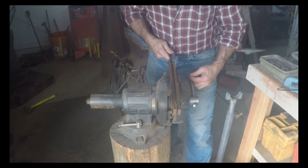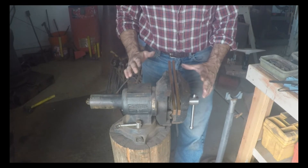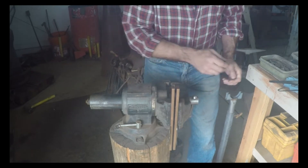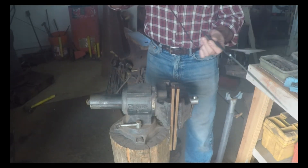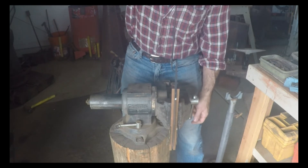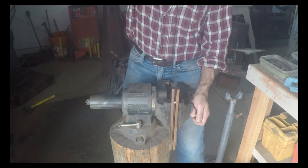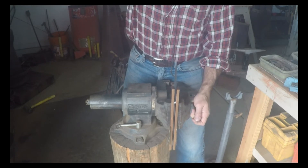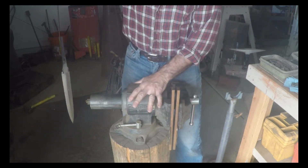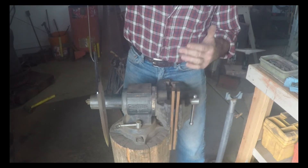The really important thing is that whatever you set this vise on, you need to be able to rotate the head so it hangs down straight. You're going to come out of the quench with your knife on this hook and come in here and just tighten that up and hold it nice and tight. So whatever vise you use, it's got to have a rotating head, and whatever you put it on, you have to be able to rotate that head so you can get those bars dead vertical.